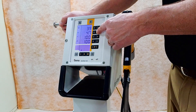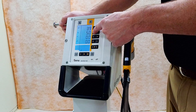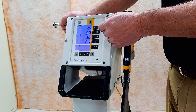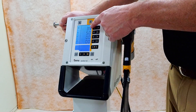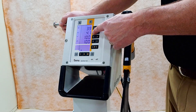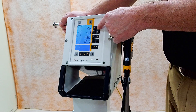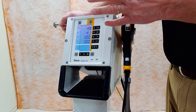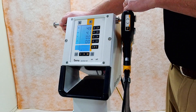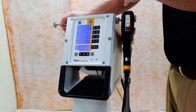When we bring that number up, it also increases the percentage shown — that's 39% of 5 meters cubed per hour coming through the unit. People typically speak in CFM in the States, so think of that as 5 CFM, and this is 39% of that 5 CFM. As this number decreases, the powder output percentage is of a lesser value. Those settings also affect the velocity of the powder coming out of the hose and gun and how it performs going onto your part, so you have to be conscious of that.